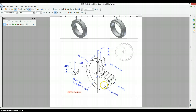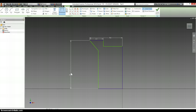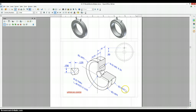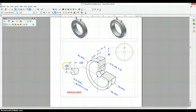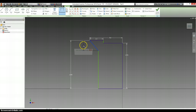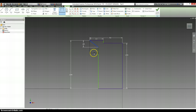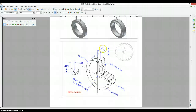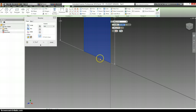This outside diameter is 2.1875 — we want half of that. And this diameter is 2.0625, divided by 2. Then if we look at the detail here, this angle comes down 0.156 and it's 0.125 wide. That should encompass just about everything, so let's revolve our sketch around this axis.